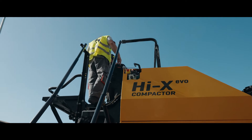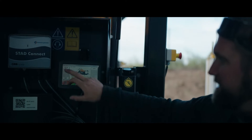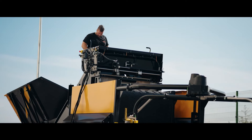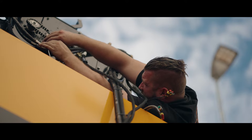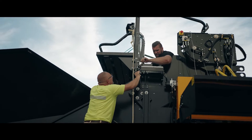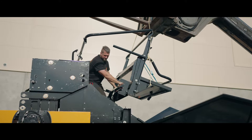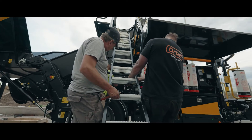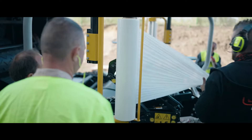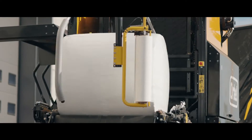The operators need to take care of the machine, doing proper maintenance, and the process is very intuitive and easily integrated in a waste management plant. The assembly of the machine is carried out by one or two Orkel technicians and usually takes one to two days. For an initial understanding of the machine, it is advisable to have the future operating personnel available. The net tying device, the upper platform, the ladder and other components are screwed on. The wrapping arms are positioned and fitted with foil rolls.